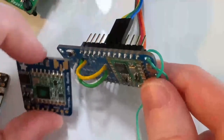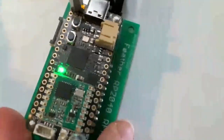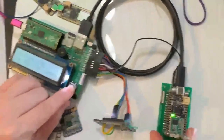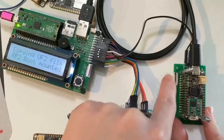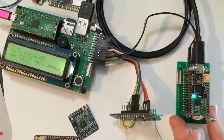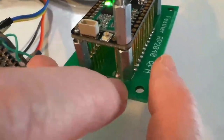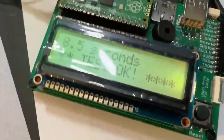I need to go to the office and grab one of the modules that matches the right frequency. Over here is the feather — the tester programs the test firmware onto it, which tests all the GPIO and checks the voltages, then communicates back and forth with this radio to make sure the radio and antenna are working. There's a little faux antenna that connects to the pogo pin, and on success you get an OK test.